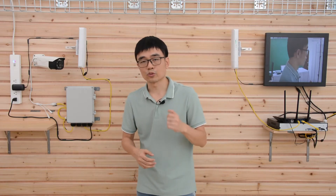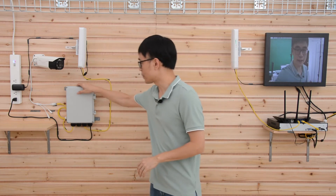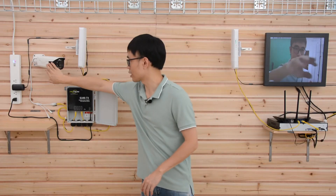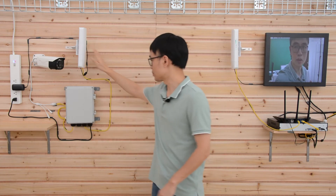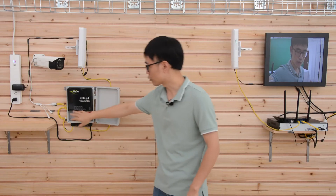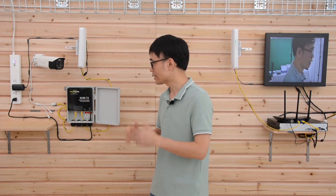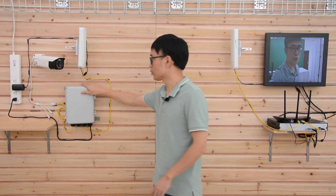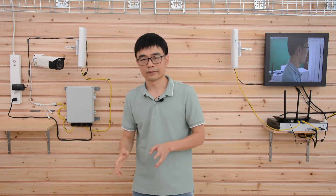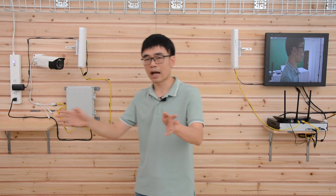Here's the solution. We use just one pair of wireless bridge — one transmitter and one receiver — but we also add an outdoor PoE switch connected to the transmitter. The cameras are not connecting directly to the transmitter; instead they connect to this outdoor PoE switch. The transmitter also connects to this outdoor PoE switch. The outdoor PoE switch has multiple PoE ports which can supply both power and data to each of the IP cameras. The maximum distance between a camera and this outdoor PoE switch is about 300 feet. We can place this outdoor PoE switch and the wireless bridge just next to the river, making it very easy to find a clean path to the receiver. The key is adding this outdoor PoE switch acting as an aggregation switch, handling the video from the multiple IP cameras.